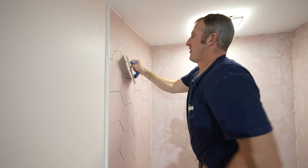It's worth having that leveling system — it really does make this look nice. These tiles are pretty even, they're really well made, and I'm super happy with the tile we got here. Because if you get a hexagonal tile that's not even, it's an absolute nightmare. If you're an eighth of an inch off — which our other bathroom had — it throws off the entire pattern extremely badly.